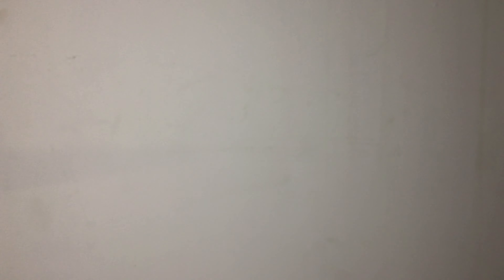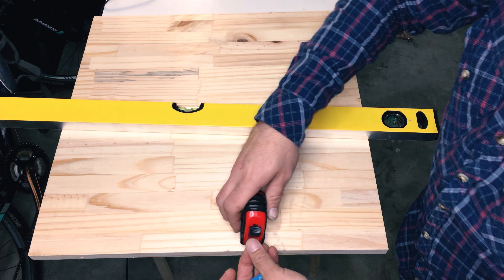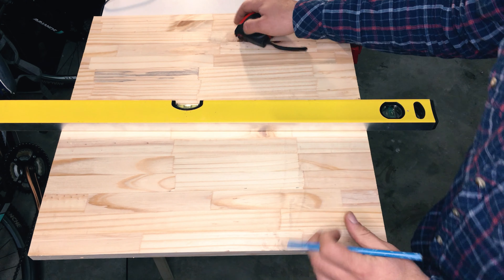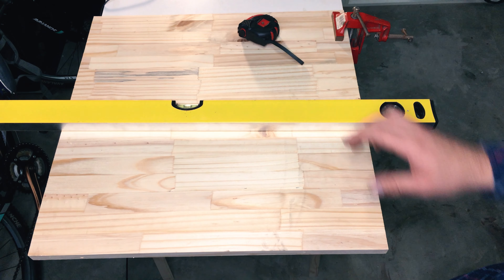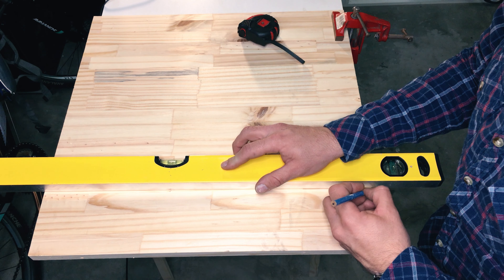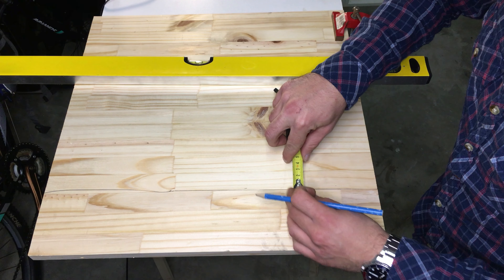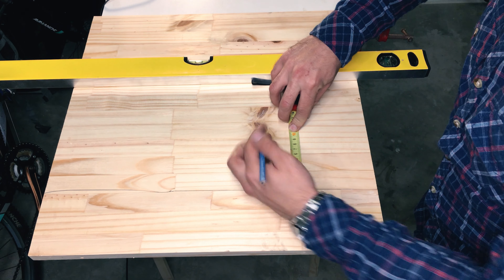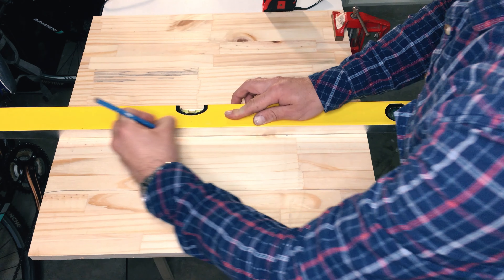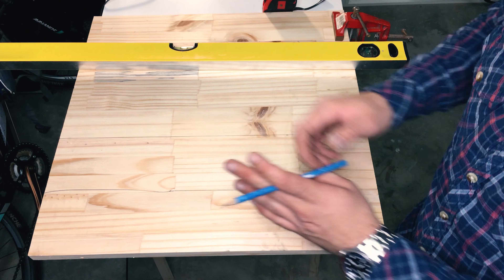What we will be doing now is using the full length of the 50 centimeters, but we will measure out about 10 centimeters in. We're going to need two planks, 10 centimeters by 50 centimeters. You can just draw yourself a line — it does not have to be 100% straight. Mark another 10 centimeters in, draw your line right through. Now we have two 10-centimeter planks — we're going to cut those out and that is the basis of our washing line.